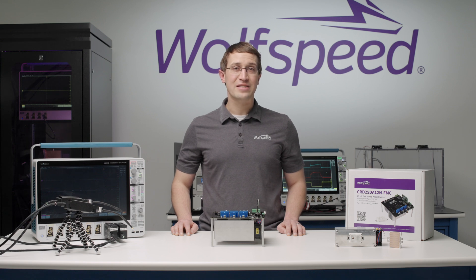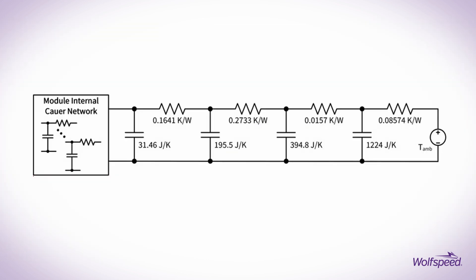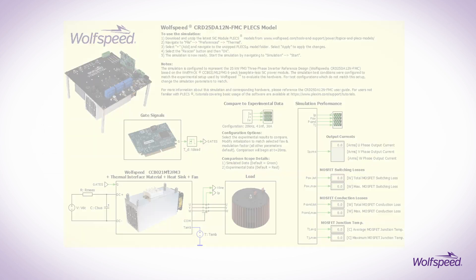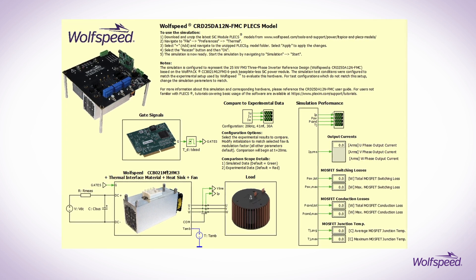This design is air-cooled and requires a single fan to operate the system at full power. Notably, the heat sink used in this reference design was specifically characterized while attached to the circuit board in order to provide an accurate thermal model of the entire system. All thermal measurements are included in the user guide and can be used to populate simulations to better predict performance.